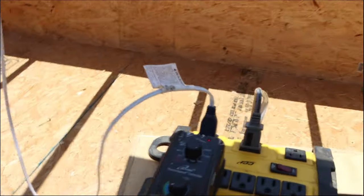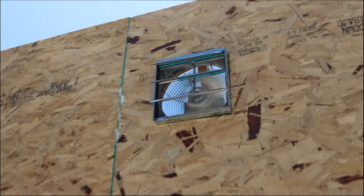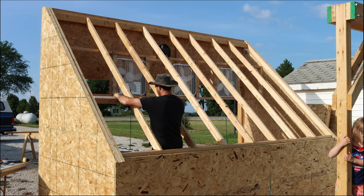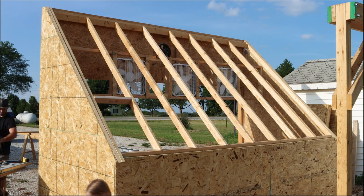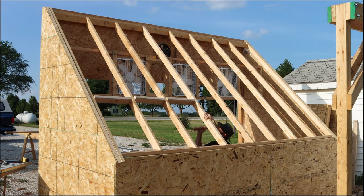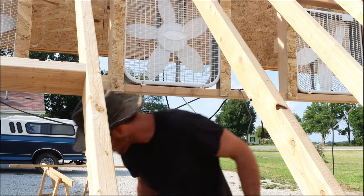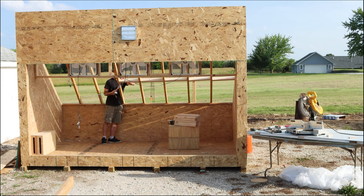Because I had the fans in place, I had to test everything out to make sure it was working. Since everything is working perfectly, I can finally finish up the roof. I needed to nail two rows of 2x4s into the roof frame so I had something to attach the polycarbonate to. I'm really glad I did this after everything was put together, because knowing how much overhang I want on the bottom of the roof let me measure the polycarbonate and figure out exactly where to put this top row of 2x4s.